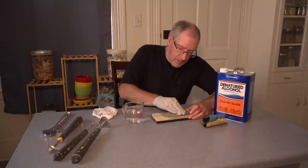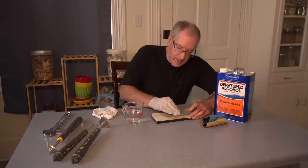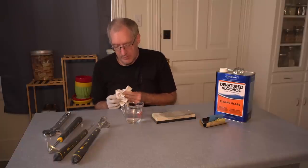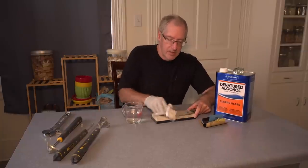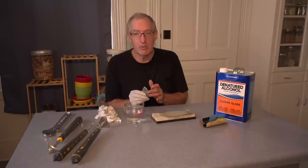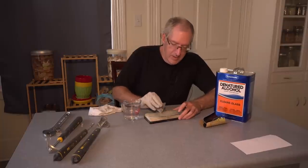At this point the entire blade is already flat so I don't have to worry about maintaining any curls. I can feel the stone grabbing even though it's soaking wet - I just have to keep a good grip on it and keep it moving. These stones will last for years by the way. I'm going to wipe that off - the blade is really covered in grit and metal dust - wipe off both sides. Way better than it was when we started. When I started this process the blade was extremely dull, and that's my fault for not doing this from time to time.